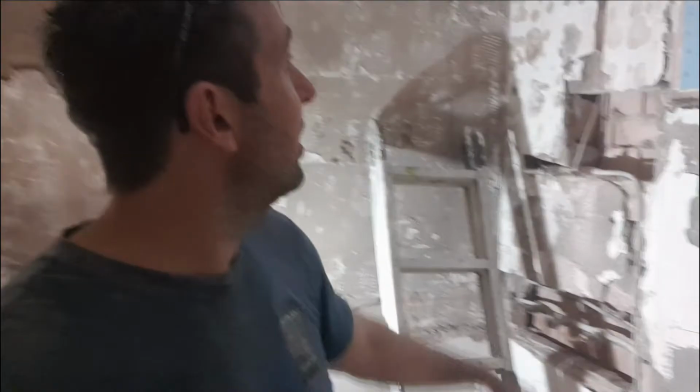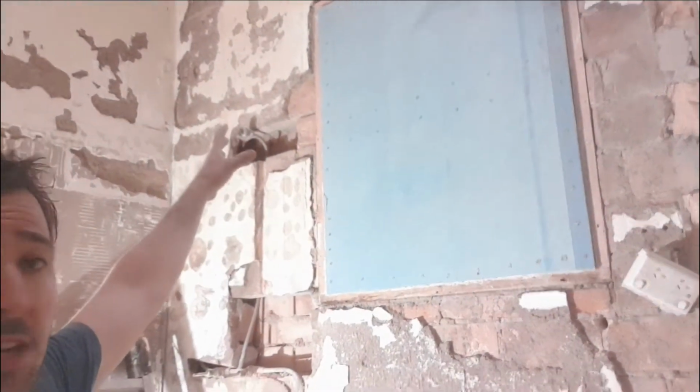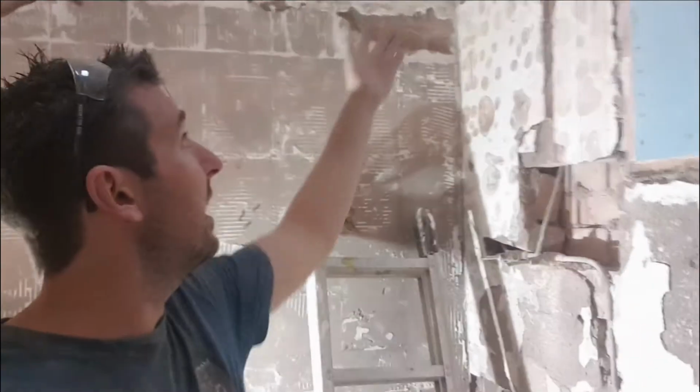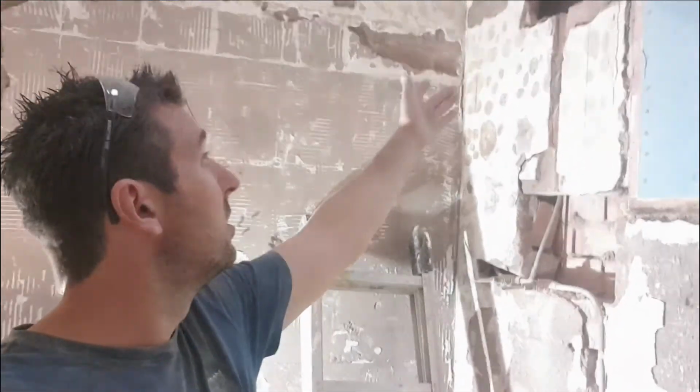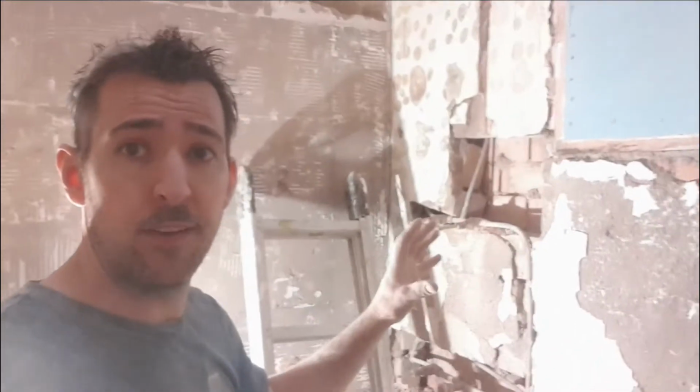The other thing you see me do was we come over here and we knocked a couple more bricks out up the top there and down the bottom here, because we are going to go a wider shower now. We want that shower head to still be central, so we've got to drag it over a couple 100 mil, line it up, and it should be fantastic.